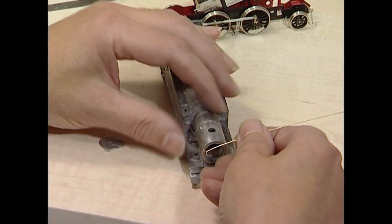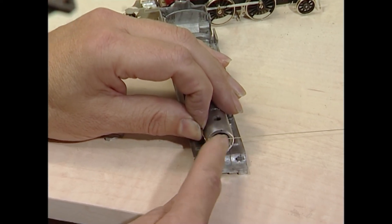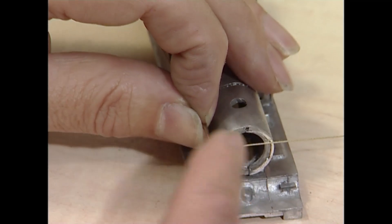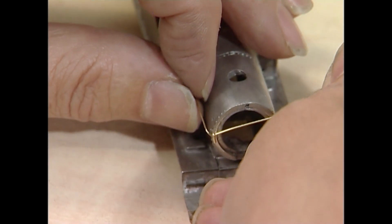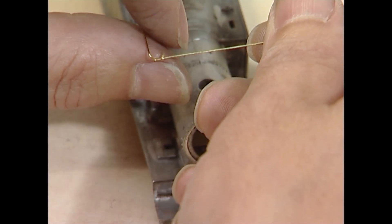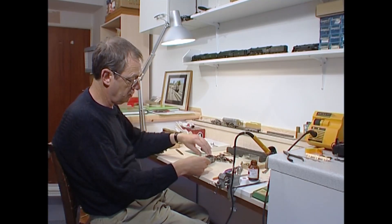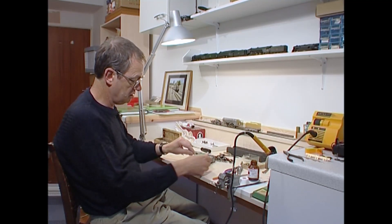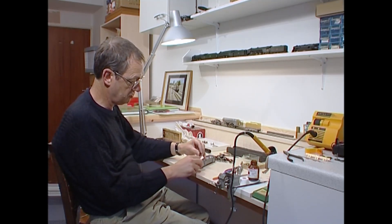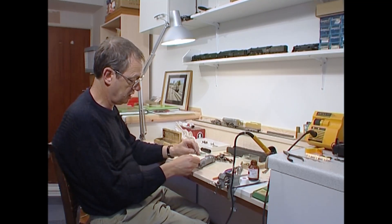It really is a little bit of trial and error. What you've got to do is replicate that curve at a slightly wider radius — that is, a slight distance away from the smokebox, the distance being the depth or length of the handrail pillar. The way I try to tackle it is a kind of mirror image way, where you sort of put it back to front.